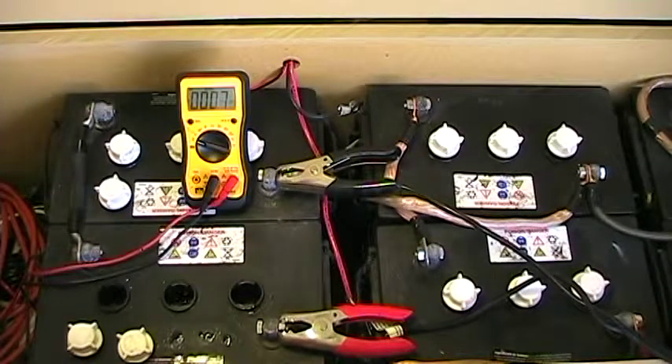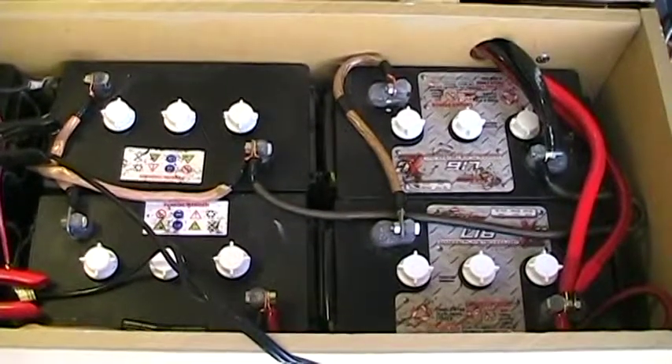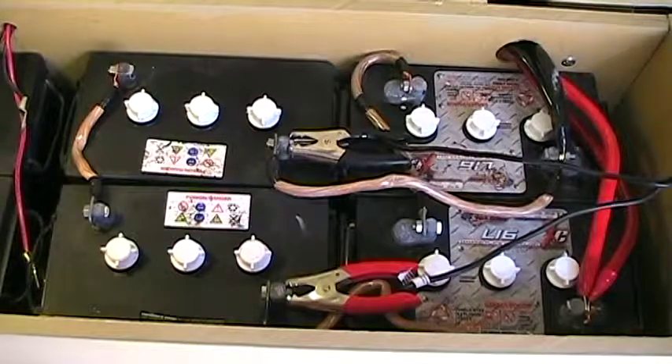This being a holiday weekend, I'm not going to be able to buy a replacement for a couple of days, so I'm going to stop this now, isolate this string again, and hook the other pair of strings up to my inverters and just go with that until I can replace this battery. I'd hate for things to go wrong and be down a whole string. For the next couple of days I'm going to be running a 4-battery bank rather than 6, just until I have time to replace that battery. Anyway, that's it for now — thanks for watching, please subscribe.